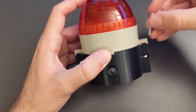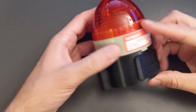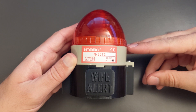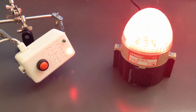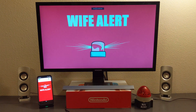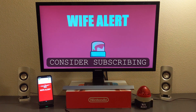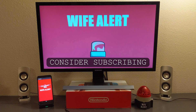I wanted to attach the light without anything sticking out the bottom of the case, and I didn't want to screw directly into the plastic or try to print threads or capture something threaded. So I left two holes open in the back just wide enough to capture a nut so I could screw the light onto the base nice and tightly, and from the front you can't see anything. And that's it. The code, models, circuit diagrams, and a parts list are in the description. I glossed over some of this, but the code has some more information. Let me know if you have any questions. Thanks for watching, I'll see you next time.